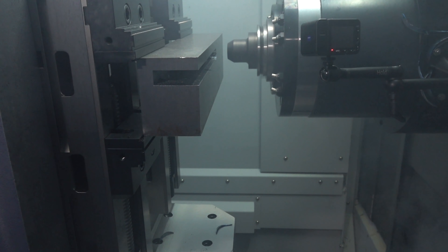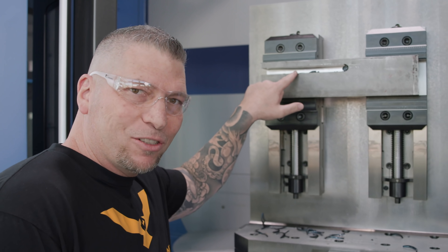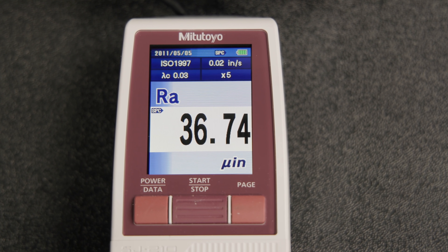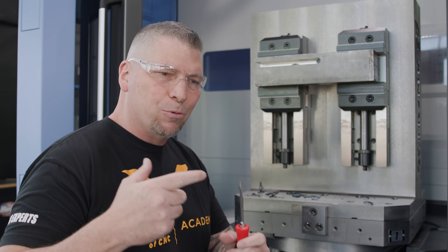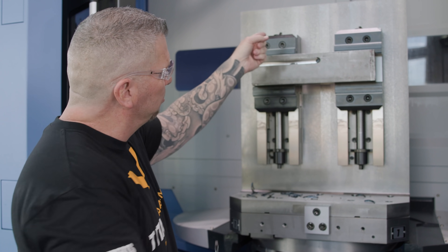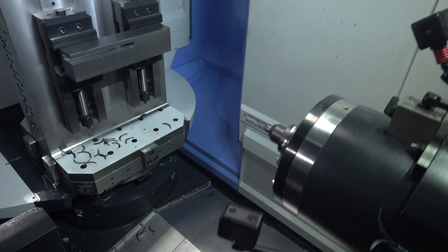We got a broken tool, granted, but we're going to do it again. Look at that surface finish right there — three times diameter deep, full slot. Look down inside the slot at that surface finish; it's probably closer to a 32. Even the walls — the surface is so good. That tells me the cutter was just perfectly engaged, rolling right through. The only problem was no air and no coolant on such a deep cut — the chips had nowhere to go. It might have been different if I started from the bottom so the chips were actually falling. Let's do this again — ding ding, round two!